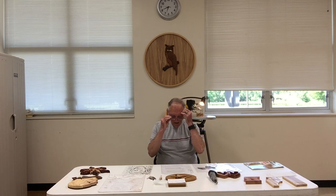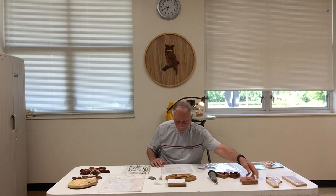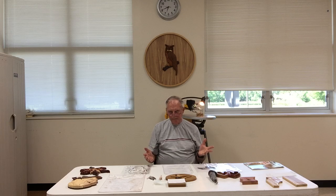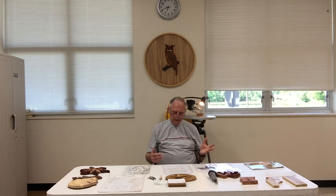For wood selection, make sure the wood is square and flat on both sides, and that the scroll saw blade is exactly square — otherwise you'll end up with gaps when fitting pieces together. Let your imagination go. Intarsia originated in 15th-century Italy during the Renaissance, where artisans would decorate doors or walls and create mosaic pictures from different types of wood. That's how this art form came about.